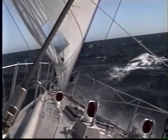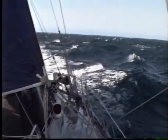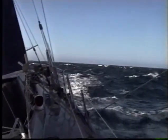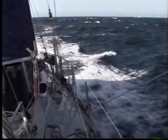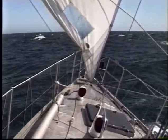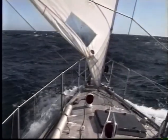Reef into the mizzen so the spinnaker will fly better with the wind so far aft. And the mizzen spinnaker's luff has been moved to weather to get it into clear air. Sundeer just loves this rig, and so do I. Running off like this, the harder it blows, the better we do. Notice how stable Sundeer is. That stability comes in large part from her boat speed.